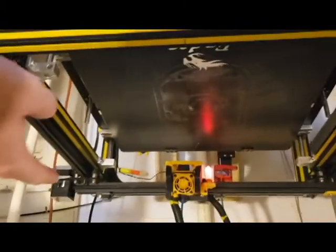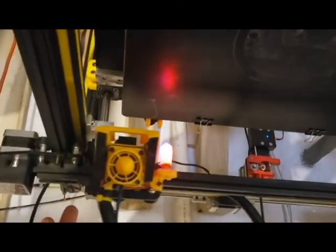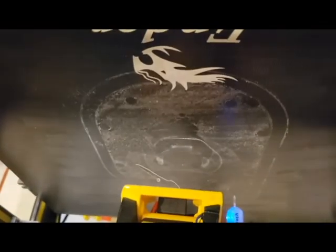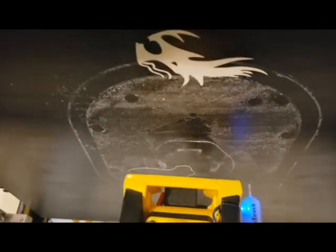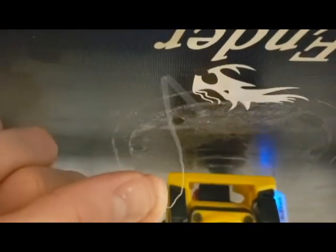and you're going to hear the printer moving. It's going to its home switch on the x-axis, and then there'll be another y-axis home, and then this is what they call the BL touch, sticks out, and this will set the Z position. You can see there's a little bit of filament kind of stringing out here. I'll pull that off real quick. You can see this little hair that is oozing out of the nozzle. It does a fast home. Now it's referenced. Everything's in position.